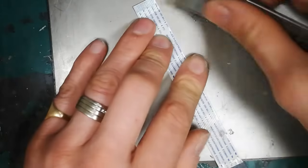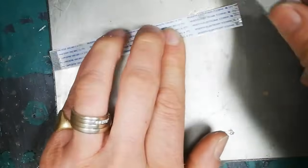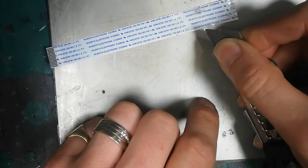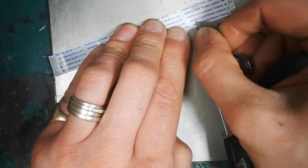Let's say you want to break out a pin or maybe a couple of lines are broken somewhere in the middle — that's a little bit more tricky. You might think to just solder a wire straight off the end connector, but because the tracks are so close together it's really easy for solder to flow from one connector to the other and make a mess. So the best way is to stagger it.